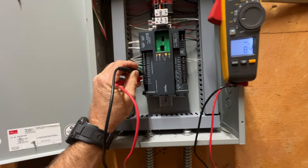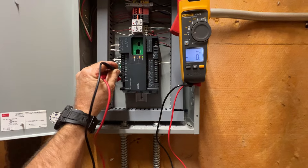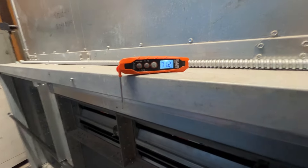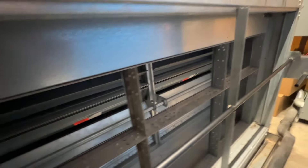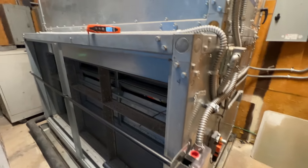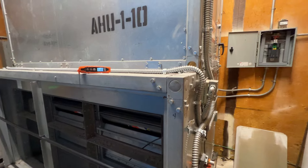I think that's going to do it. 8.4 volts to the water valve and our damper is now back to 3.3 volts. Temperatures are back down to 71. And that water valve — it's definitely backing off some. So I think everybody's talking to each other and communicating.